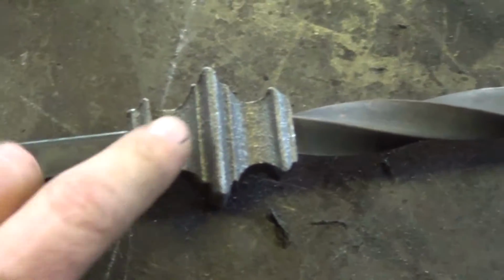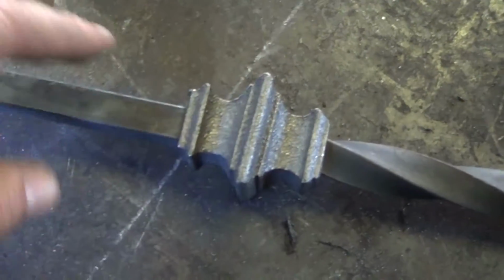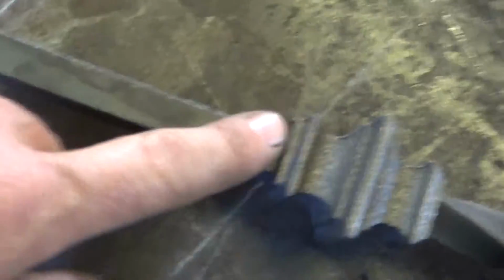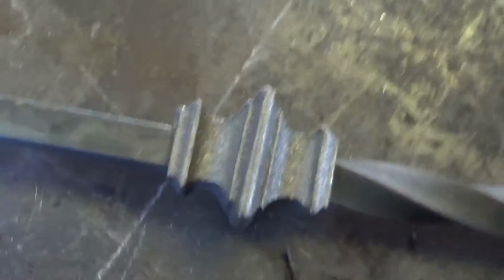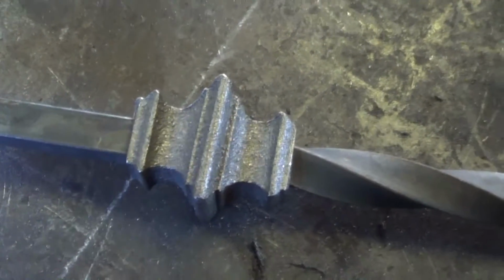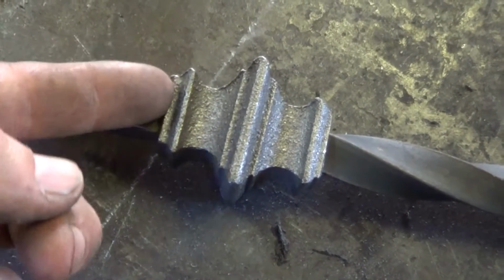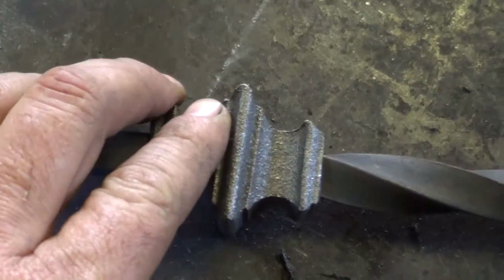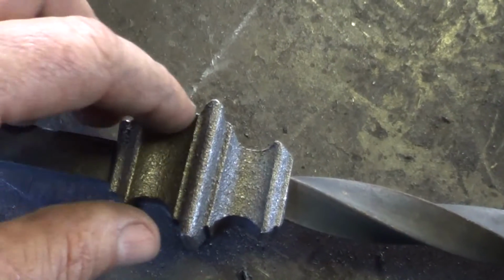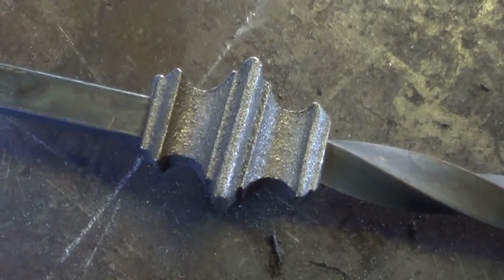We've got to attach these knuckles to these pickets here, and there's about 3 different ways that I know of to do this. The quickest, easiest thing you can do is run a weld right through here all the way around. You see that all the time, especially when there's a large quantity of these things to attach, because it's just quick and easy. You don't even have to go all the way around. You can sometimes just do 2 sides. It's cast iron. Welding to cast iron is a lot like trying to glue something to styrofoam. It sort of sticks to wherever it's at, but it just falls apart.